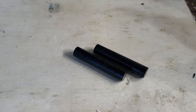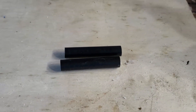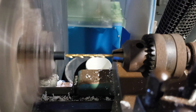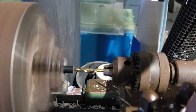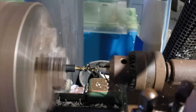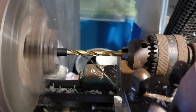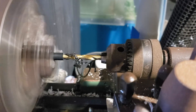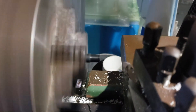So instead of just doing it, I am going to take you through all the steps — I hope you don't mind. These are just two blanks I just cut off; it's easy to cut them in the saw, it's a very easy material to work with. I'm going to put this in the lathe now. I'm going to drill a quarter-inch hole, but I'm going to go one size smaller first — same reasoning as with any other drilling: it will expand if it heats up too much. So I'll take a smaller bite through at the depth I want, and then run the quarter-inch through it. That should give me a nice homogenous, clean hole. I touched the bit afterwards and it wasn't warmed up enough to cause any issues.